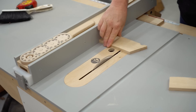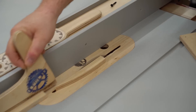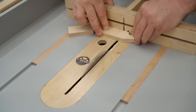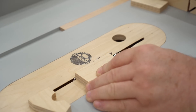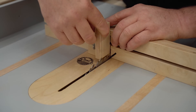I'm going to get started by cutting the pad for the sander and that's from the half-inch plywood. I've got a piece left over that I'm going to cut to make the ends for the sander as well. These also need slots for the sandpaper to fit through and I'll lower the blade down to a half inch and make those cuts with my mini table saw sled.